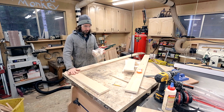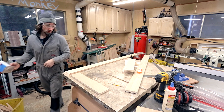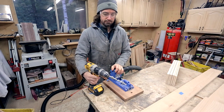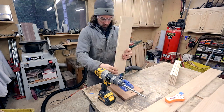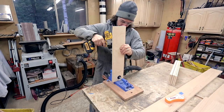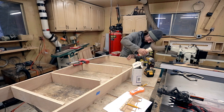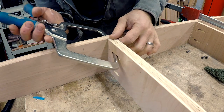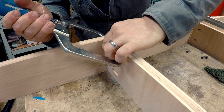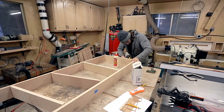After I do the biscuit on the 45-degree cut, the others are just going to be pocket holes, so I'm going to mark that and cut and drill them — using the Kreg jig. I then drill out two pocket holes for each joint. I put on a bit of glue and then use the Kreg pocket hole clamp to align things up. I squeeze it tight with a clamp and then screw in the screw. The screw choice is important, and for plywood you should use coarse thread screws.